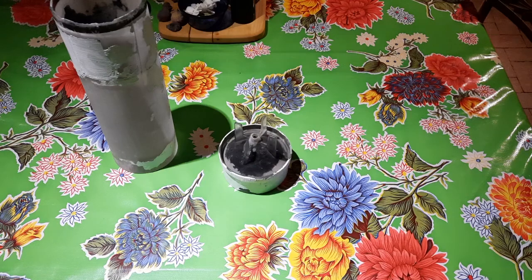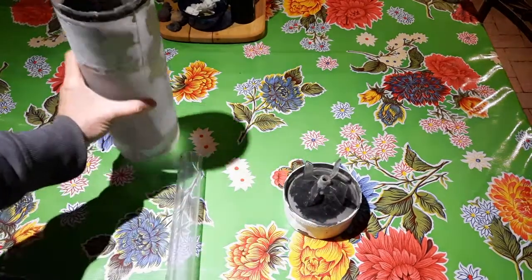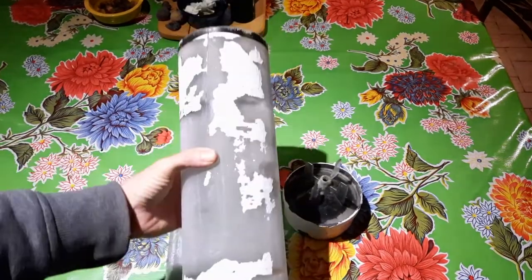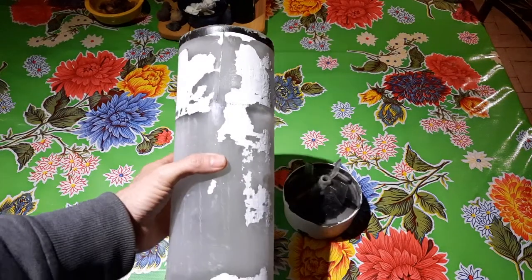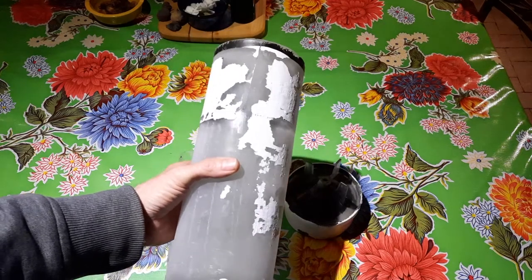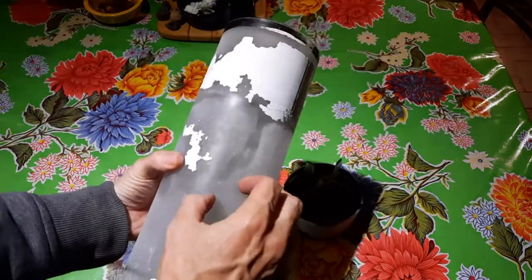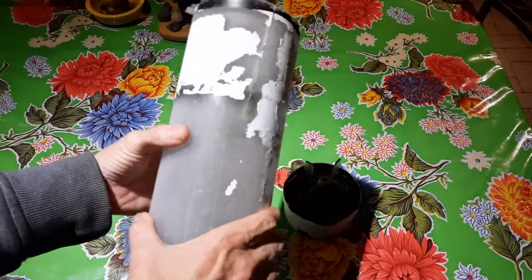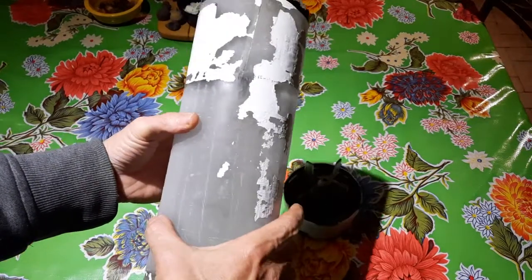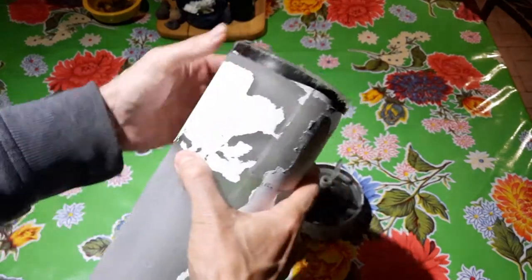I'm assuming there will not be any precip for the evening. So this is what happened to the gauge since 2005. We're at 7,000 feet elevation so we get 35% more ultraviolet light than at sea level. What I did years ago is I scarified the surface of the rain gauge because it was getting white like that, and then painted it black — you can see some of the black paint still sticking to it here.